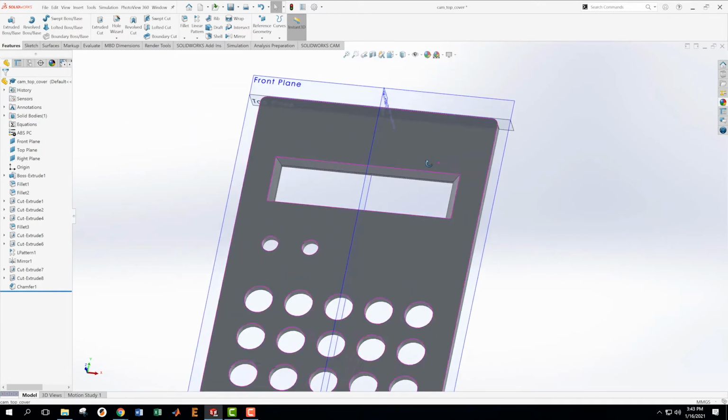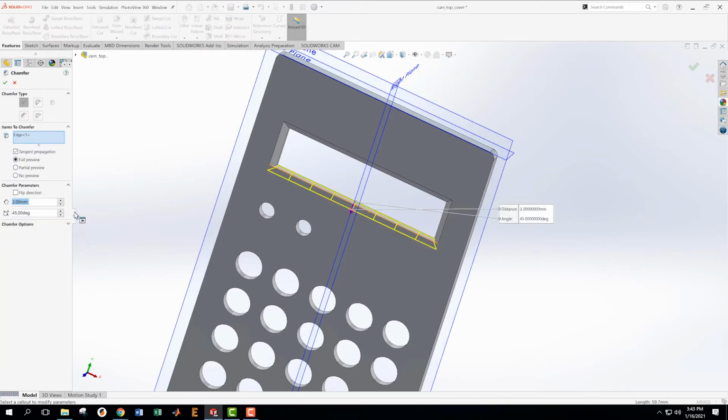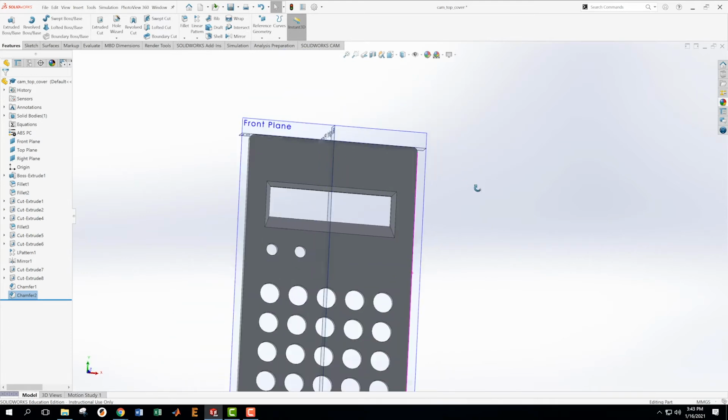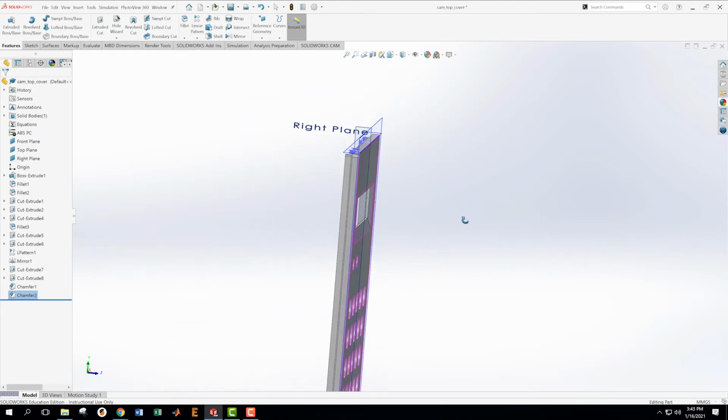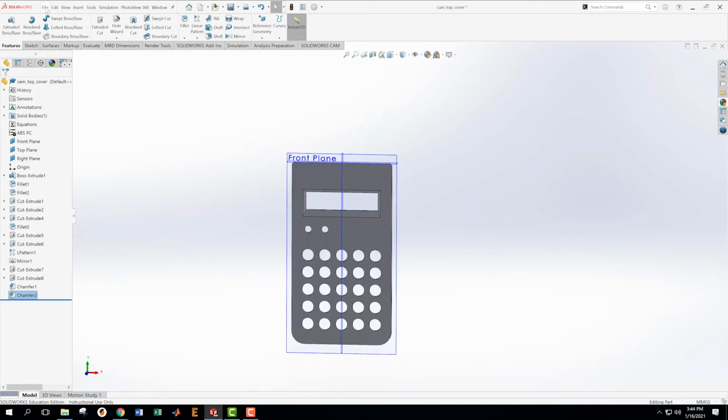Excellent. Now it's time for us to see if we can figure out how to do this bottom one. This might be more complicated, or it might not be. Choose it. Come over here. Hit chamfer. And on this one, we are in the same situation, which is that we want to go into this option, and then lengthwise we want to be 5. And then depth-wise is 1.4. Yes. That's what we want. It's looking great. Okay. Come in here and save this. Save.